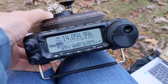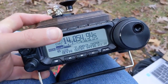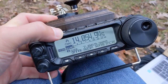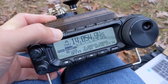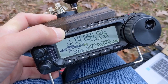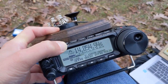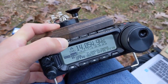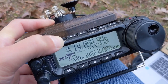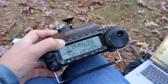A little commentary — look at that signal on the S-meter. This is kind of hard to do with one hand, but I was going to comment on how different it is when you're in a low-noise situation. That signal is going over S5 most of the time now, but it was hovering around S3 and it was not just audible — I was having to turn the volume down. At home I've got a solid S7 noise floor most of the time, at least S5 always, so here I can just make solid copy of an S3. It makes a ton of difference.